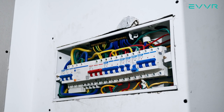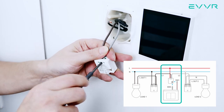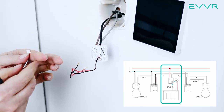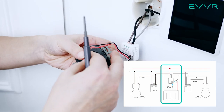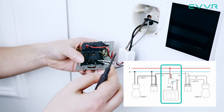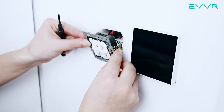Then, once again, turn off the power to proceed. Now we can connect the brown live wire to the L connector at the top of the smart switch sub-assembly, connect the black load one wire to the L1 connector, and the gray load two wire to the L2 connector. Next, collect both of the small panel connector wires. Take the black and red one and insert it into the SW1 jack on the smart switch sub-assembly, and then connect the black and white one to the SW2 jack. Take the small red wire and connect it to the L1 terminal of the light switch, connect the small white wire to the L2 terminal of the light switch, and connect both of the black wires to the L terminal on the light switch. Installation of the smart switch sub-assembly is now complete, and we can put everything back in the electrical box.